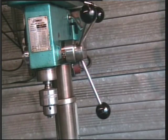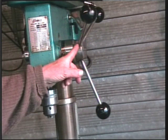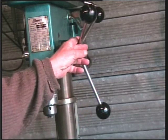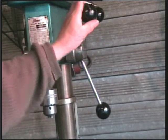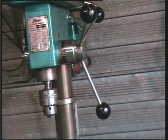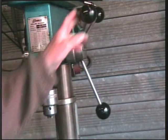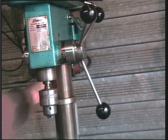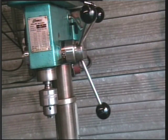Here we have a cheap drill press, and these tools are false economy. They look quite good, but the shortcomings very quickly develop. In this case, the motor burnt out in no time at all. The threaded parts of the handle, the threads, I can only describe as monkey metal. Stripped, and I've had to weld them. The plastic knobs on the end were so flimsy, they kept coming undone. When you tightened them up, they fell in two halves. Quite ridiculous, really. Even the column, which is cast, they'd left a core plug inside. And when I turned the machine upside down, I must have had half a kilo of sand fall out. If I'd wanted a sand castle, I'd have bought one.